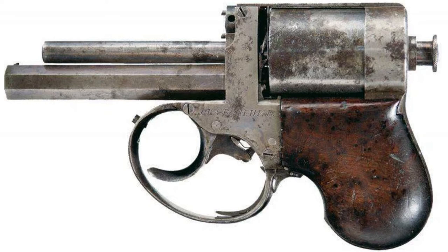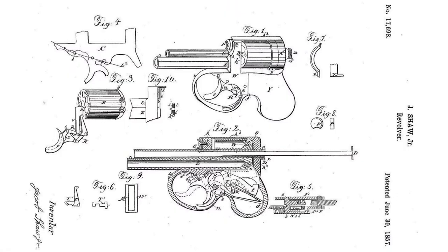The cocking handle is at a 45-degree angle, and the trigger itself is in the hollow grip. The cocking lever, made in the form of a trigger, is used to cock the hammer and turn the barrel. The trigger unit itself is pivotally mounted at the rear of the trigger guard. The magazine housing is fed from a removable drum, loaded with six rounds. The sights consist of a sighting tube located in the hollow shaft of the drum, and a fixed front sight in front of the barrel's muzzle.